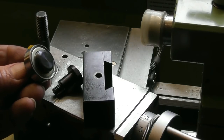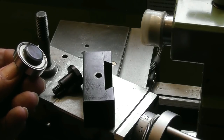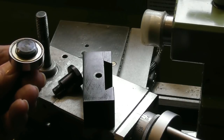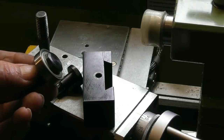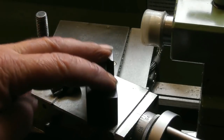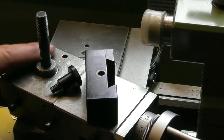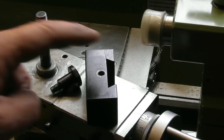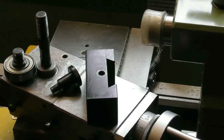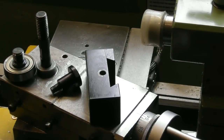Ready to move on to making more blocks now that I have the material for the rest of the tool holders. I'll be so happy if I can just make one for the turning tool alone — just for the left hand tool — to use the new quick change tool post on a more regular basis. I won't show the machining of the dovetails because you've seen me do that on this block. I've now got a block I'm happy with, so I can use the two pins to measure this one and make all the others the same size across the two pins.